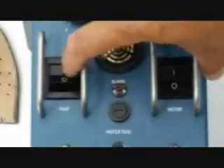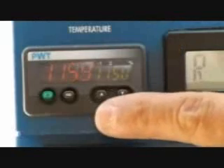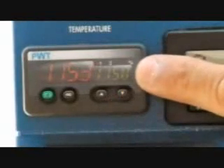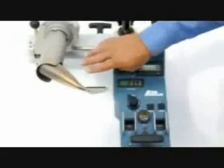Next, locate the heat switch. When you turn it on, an indicator light will show the power is being fed to the torch. Look at the temperature readout just below — the up and down arrows let you set the machine's temperature. The green number is the set temperature, while the red number is the actual temperature. When the torch comes up to temperature, the red indicator light will periodically flash to show that the torch's heat is being maintained.